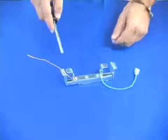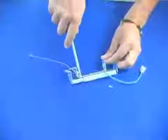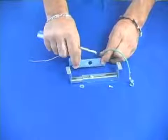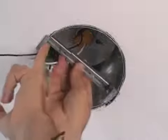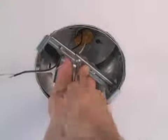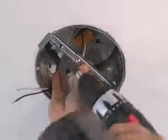Before we can use the brace assembly, we need to take it apart. We need to remove the crossbar mounting bracket from the brace by removing the two side screws. Just be careful — there's a washer between the brace and the crossbar mounting bracket; we'll be using that later. We want to install the brace by sliding it out to the width of the can and locking the center screw in place. We then secure the brace to the recessed can using the special screws, washers, and a driver.